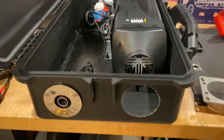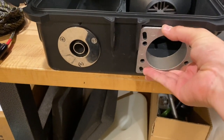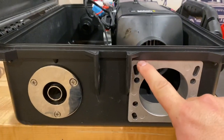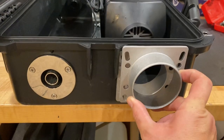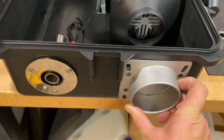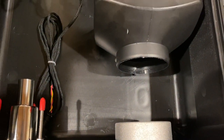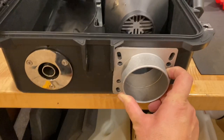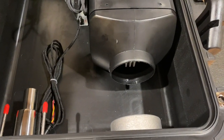When you get your hole cut, you're going to take your flange and set it inside there — nice, good fit, nice and flush up at the top. Then take your second one and mount it just like that, then drill the four holes to mount it. On the inside of the case, that's where the supplied hose will connect to the actual heater. So I'm going to drill these bolt holes now and then show you how I'm going to connect the heater hose.